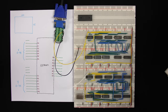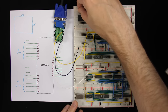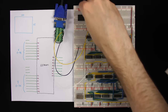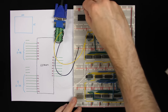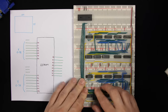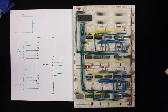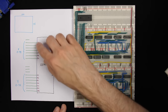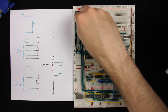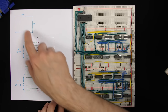I'll start by adding another breadboard and connecting power and ground to the EEPROM. I'll tie the write enable pin high since we'll only be reading — it's active low. Output enable and chip enable are both active low, so I'll tie them both low so everything's enabled for output. The first seven address lines go to our horizontal counter, skipping the first bit, and the next seven go to the vertical counter, skipping the first three bits.